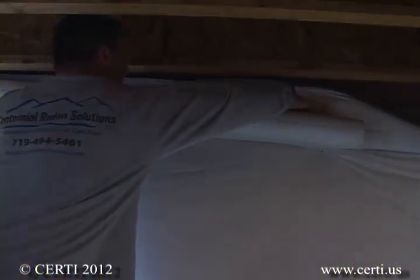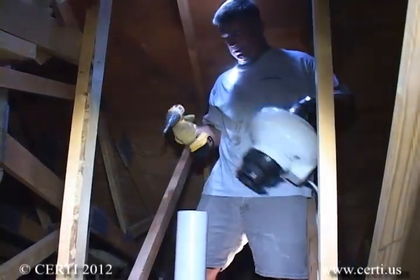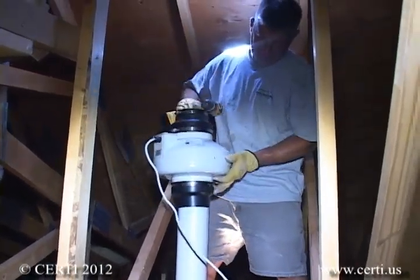There should be positive drainage back to the subgrade so condensed moisture does not accumulate and disable the system. The fan and any portions of the discharge piping should not be routed through conditioned space of the home or under occupied space.